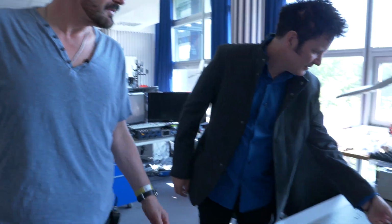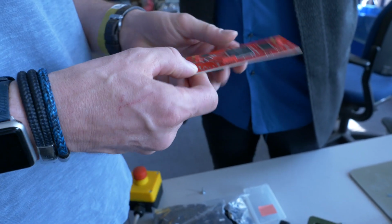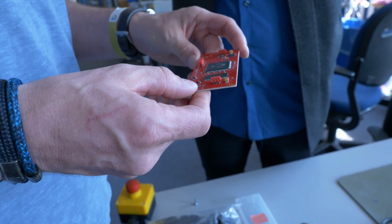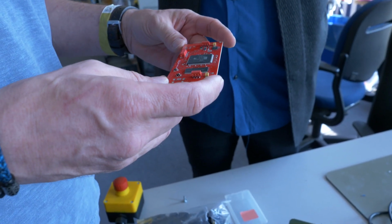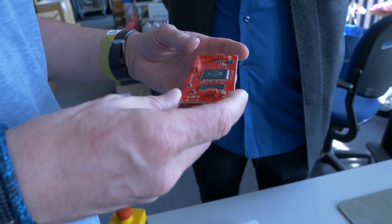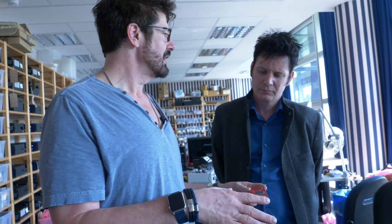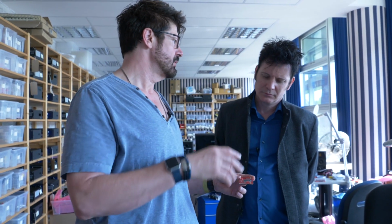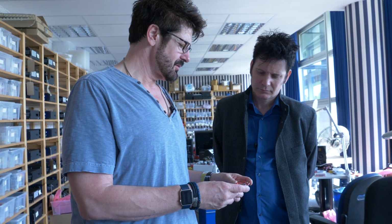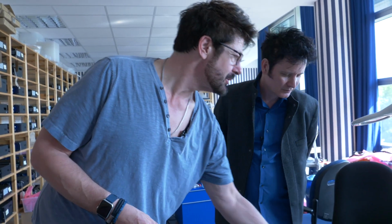So crazy. Yeah, that's how it is. So this is the soldering here. Yeah, I can see. And as you can see, for example, that's the controller for the display. Yep. And that's something you cannot do on your own with some soldering iron, so we get that from a company that is around two corners. We have chosen a local company because it's easier to communicate. I can go over and explain something, say, okay, this and this, or please, we have a prototype, please put some chips on it. For example, we first put the digital parts on it, see if it runs on a prototype, and if it runs, then we go over and say, okay, now assemble the rest. So it makes it really easy when you have someone local doing that. And they're in the same time zone as you, so you can communicate. Yeah. And we speak the same language.